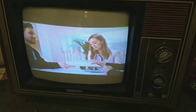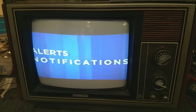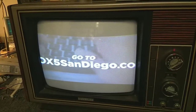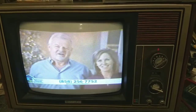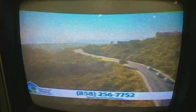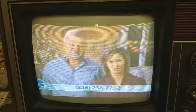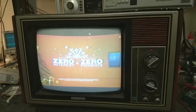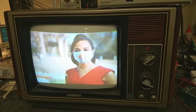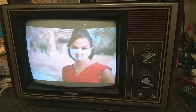There we go, it's a little better. Much better. So now that we've established a stable AGC reference, it doesn't look half bad — actually it looks pretty good. The video response isn't quite what I'd like, it's a little smeary, but it's not bad. It's still doable, except for the super fine text which you ain't really going to read anyways. Definitely could use a little video peaking adjustment — I wonder if there's anything in the service manual about that.